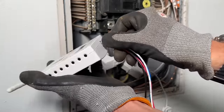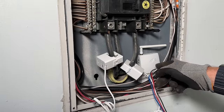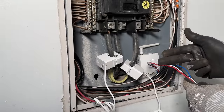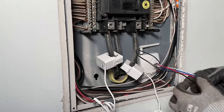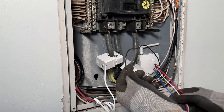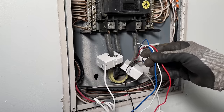I'm going to go ahead and install the power wire harness. I want to keep this as tucked in as possible, but obviously we're going to have wires coming into both sides so it is going to get pretty busy. I'm going to modify this harness — I do not need all this extra wire. Since I'm only installing one of these, I'm going to take this black hot and pigtail that into what they call a 15-amp breaker — actually, I'm going to come into a lightly loaded 20-amp breaker that's low in my panel. I'm just going to use a WAGO, bring all these wires in together, and then go into the neutral bar with all three of these as called out in the instructions.